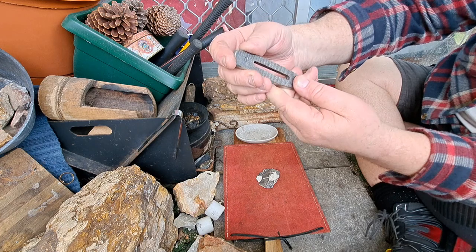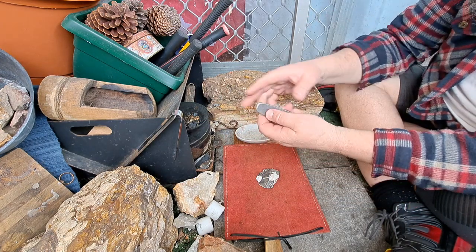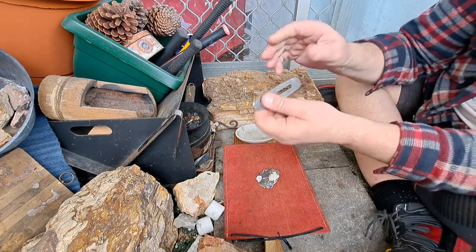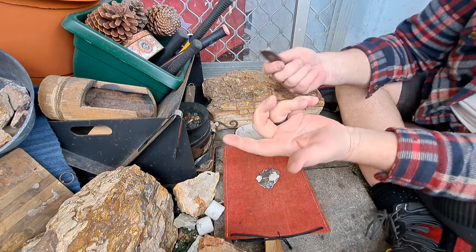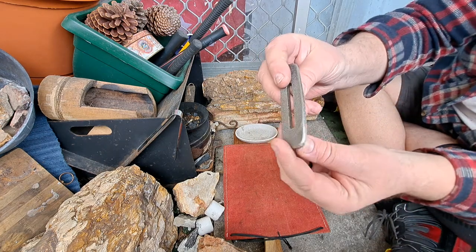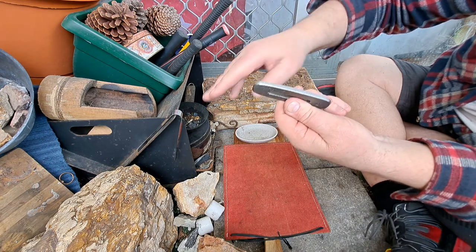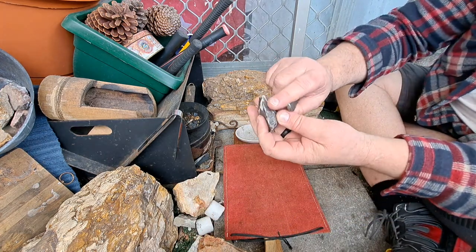Andrew's got a milling machine, so that's good. Anyway, once it's all ground up, just whack it on a wire wheel — clean it all up, gets it looking nice and pretty. Just make sure you're dipping them all the time when you grind after they're quenched because you don't want them to get hot. You should always be able to touch it as you're grinding, because otherwise if it's too hot to touch, you might have to put it back in the quench tank and re-quench it. Once it's done, they should pretty much look like that. Make sure you go all the way around to take the file teeth off, because file teeth will just prematurely burn your edge out.